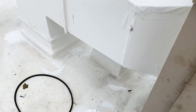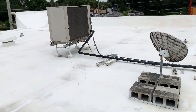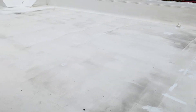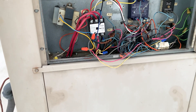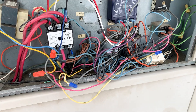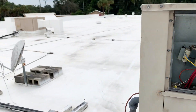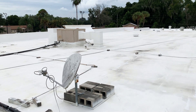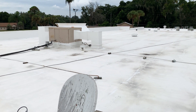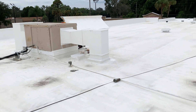I was looking at the wiring and the white wire is actually what's giving our cooling signal back at the condenser. This is a single stage unit, so I'm going to have to make a slight wiring swap in the junction box inside the unit — the yellow is not being used. So I will just break white, which is cool on this unit, which is compressor I should say. It's a straight cool and it's 88 degrees in the store. I'm going to get some readings on this unit and make sure it's running right.